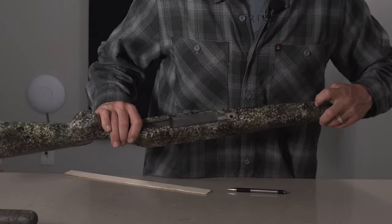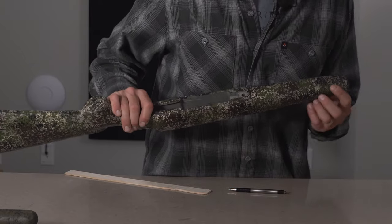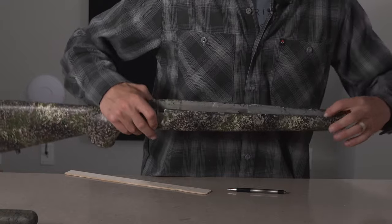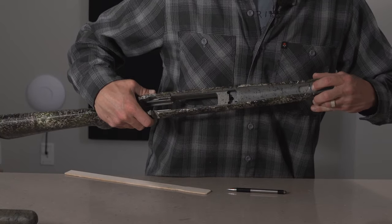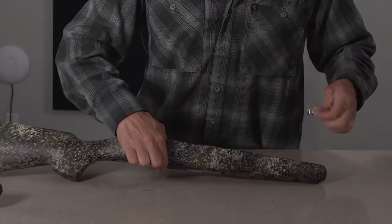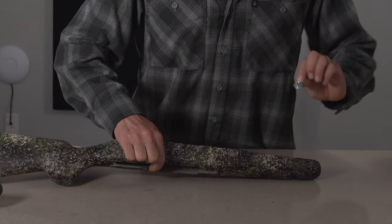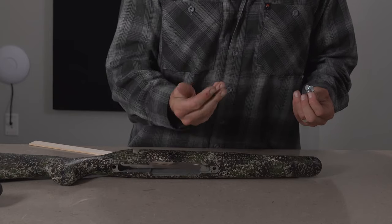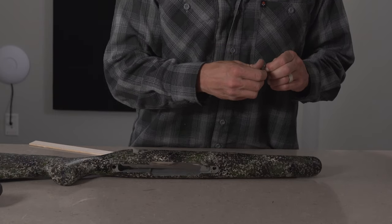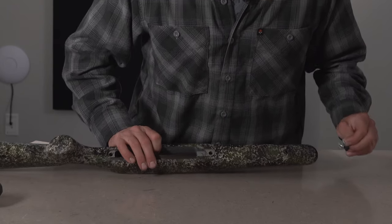What I'm going to do is drill from the bottom of the stock up through the top, and then countersink from the top of the stock to install this T-nut so that it countersinks into the stock, and then be able to mount via the 10-32 — just the standard threads they use on most rifle stocks.